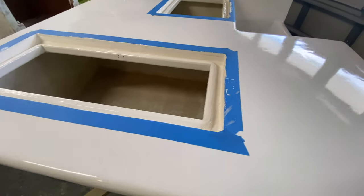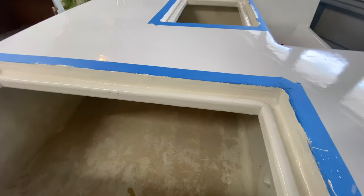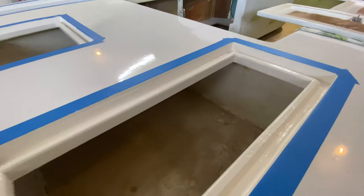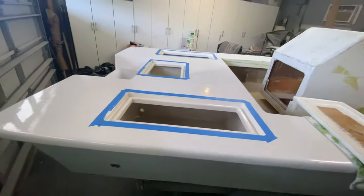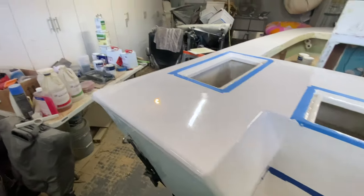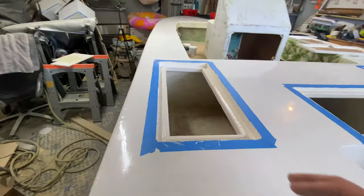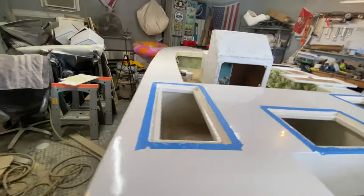I've got to be extra careful now that the top deck is done. I put in another coat of bilge paint on all the hatch drains and the actual bilge, so it looks white again. I just read on the bottle - after I painted - that you're not supposed to use this stuff when it's above 90% humidity or 90 degrees, and it's like 100 degrees outside right now. I'm gonna pull back the tape and hopefully see this dry. If I have to put a third coat on I have enough - about a third of the can left.